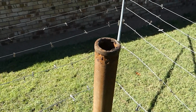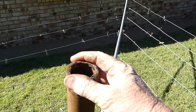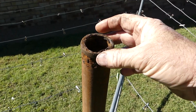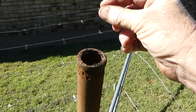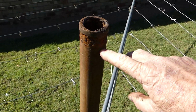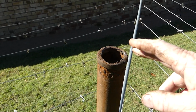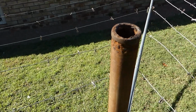Okay. I just had a look. There's a really good website, hillsparts.com.au. And it looks like what happens here is there's a conical washer, like this. This has a cone in it to centralise against that flat bar. And then there's a nylon washer that sits on top of the flat thread and rubs on here. So I'd say what I have to do is chop this off a little bit and make a cone to match the cone on the top of the thread, so that when you wind it up, the thread pushes on the cone, and that's what lifts this up through the pipe.